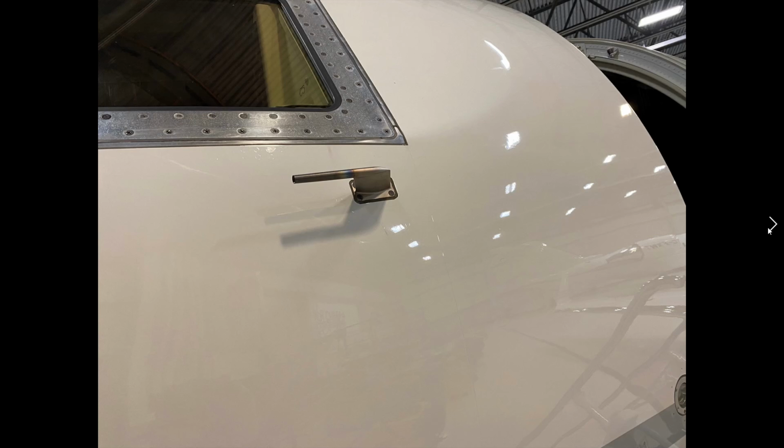auxiliary pitot tube, as you can see, it has been very hot at one point. As you're fully aware, they get very hot to ensure that no icing would occur on them. It's a mandatory thing prior to takeoff, and you'll actually get a CAS warning for it. You can try it yourself on the 650 on the Hot Start: the probes must be on prior to takeoff, and the probes and windshields would have to be on at that point.